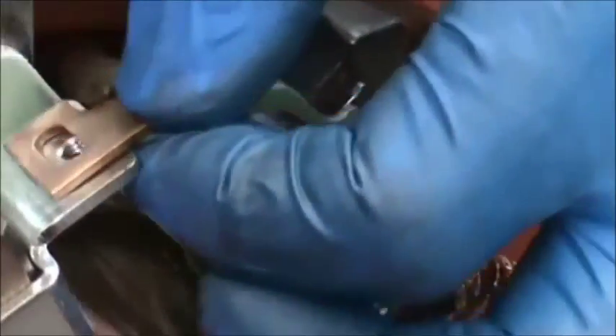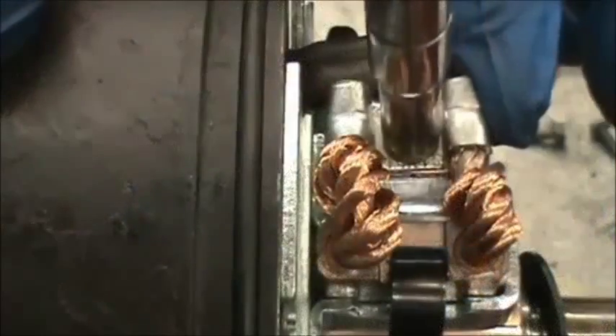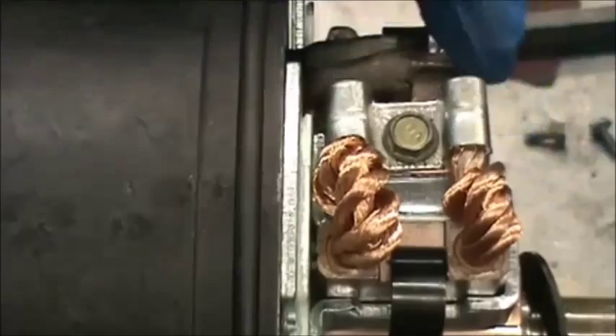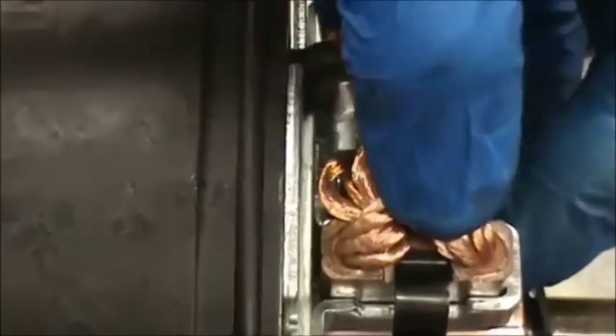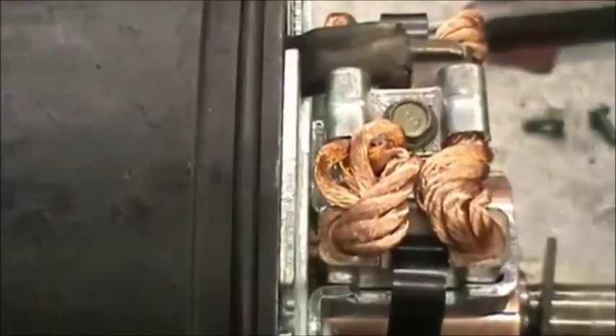Here's the other field lead — we're going to do it next. Lay it down on the brush holder, lay the brush down, get your quarter inch 8-32 started down through there, hold everything parallel as you finish it, and make it nice and snug so that everything is straight. Then take your fingers and mash the leads down so that they can't touch the outer shell.